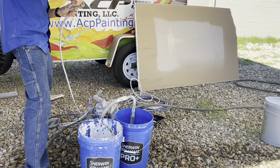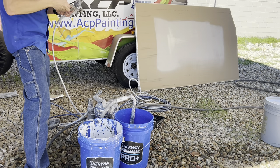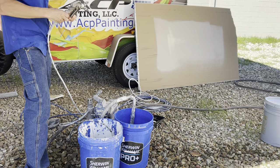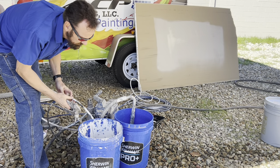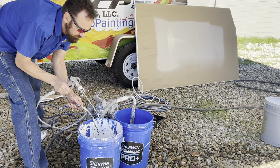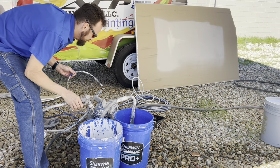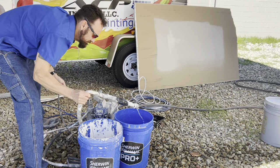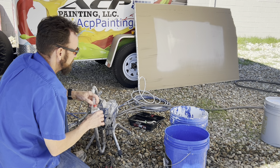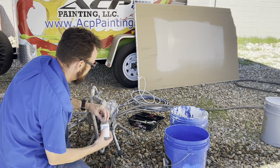Shut it off again — I'm going to put the gun back together. These are made to be hand tightened normally, that's all it takes. Give it another shot of water just to make sure you got the gun back together properly and it's still working as it should. The sprayer is completely clean, which will definitely extend the life of it. Here's another step you should actually do prior to spraying, but also a good idea to do once you're finished too, just to keep it in good shape: throat seal lubricant.